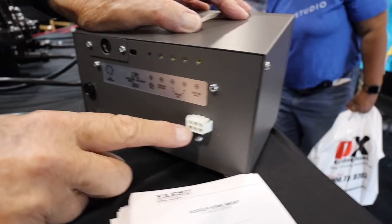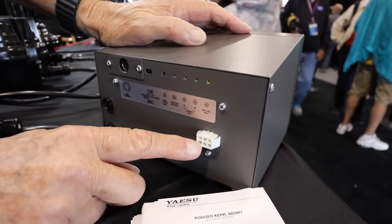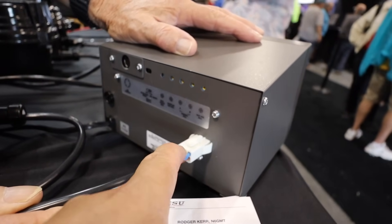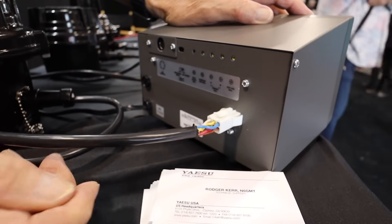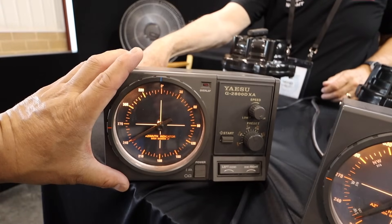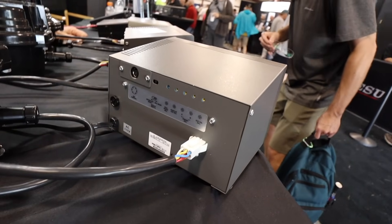I'm talking to Roger, a technician at Yaesu. He's telling me to take a look at pins 4 and 5, which should be 24 volts — plus/minus in one direction and minus/plus in the other. If you can measure it with the connector plugged in under load, that's even better. So what happened is I have the Yaesu G-2800 rotor; I sent it in for repair, Roger opened it up and said nothing was wrong with it. So now he's telling me to check pins 4 and 5 for 24 volts DC, and if it's not 24 volts, that could be why it's not going into high speed.